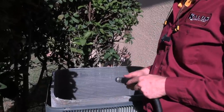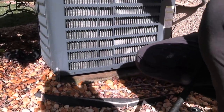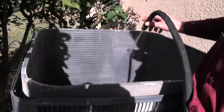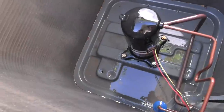You can check your compressor terminals. If it's not a plug, you actually have terminals there — make sure they actually look good, they're not rusted out. That'll tell you about the condition of the compressor. Make sure they're actually tight. The other reason for taking it off is so that you can properly clean the condenser by washing it from the inside out. The real best way to do this is to actually start by clearing out the drains of your system so that as you're cleaning, the water has somewhere to go. On the condenser coils, if they're relatively clean, I'm not going to be using any cleaners on them. I will use cleaners on the condenser when there's a lot of dirt, hard impacted stuff, or oxidization that I'm going to try to wash off. Condenser's clean — that's how it should look when you're done.